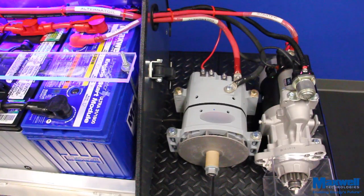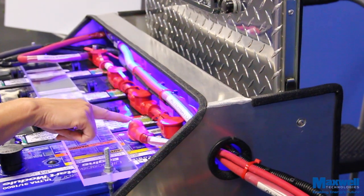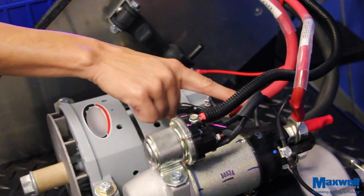In this example, we use a two-gauge cable to connect the ESM starter positive terminal to the starter motor solenoid. Since this starter motor also has an integrated magnetic switch, the only other connection to the starter positive post is from the magnetic switch.